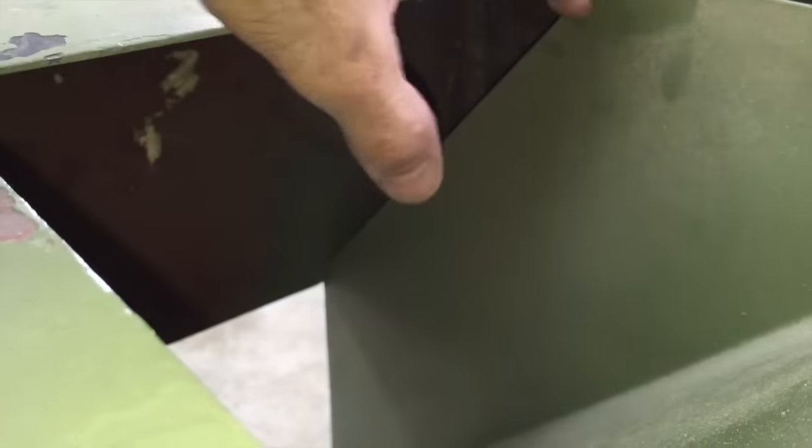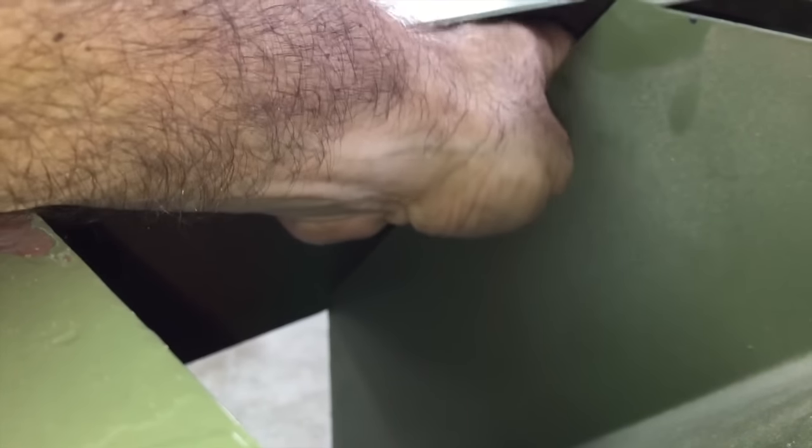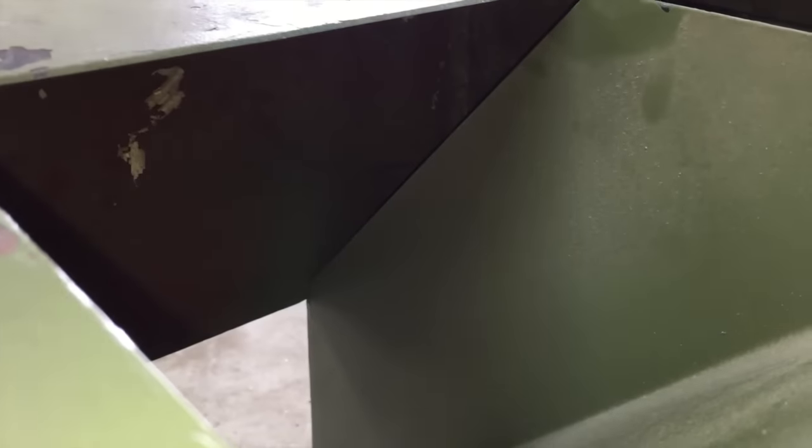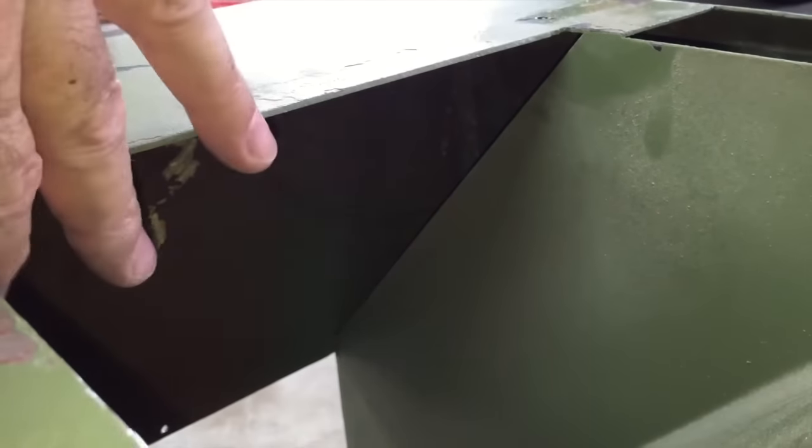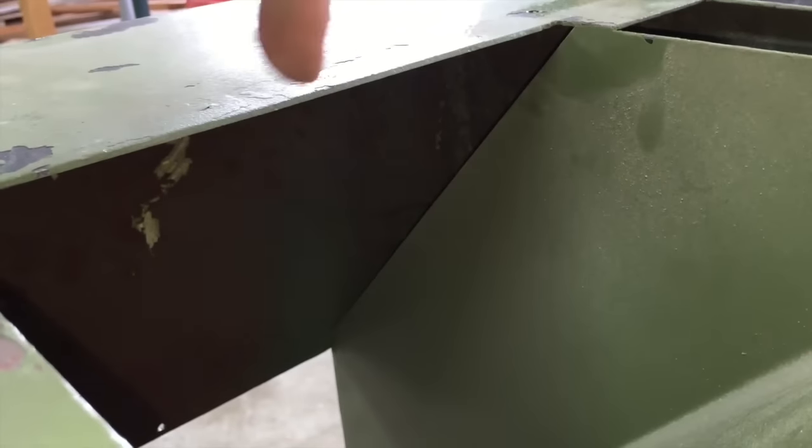With the dust chute, what I want to do is fully enclose it. If I show you inside there, the actual top of the dust chute just in here isn't enclosed, so with air movement and debris flying around everywhere there's obviously potential for sawdust to get in behind that chute and inside the cabinet. I'll put something across there to fully enclose it so that the only area the sawdust can exit is where it's meant to — straight out of the cabinet.